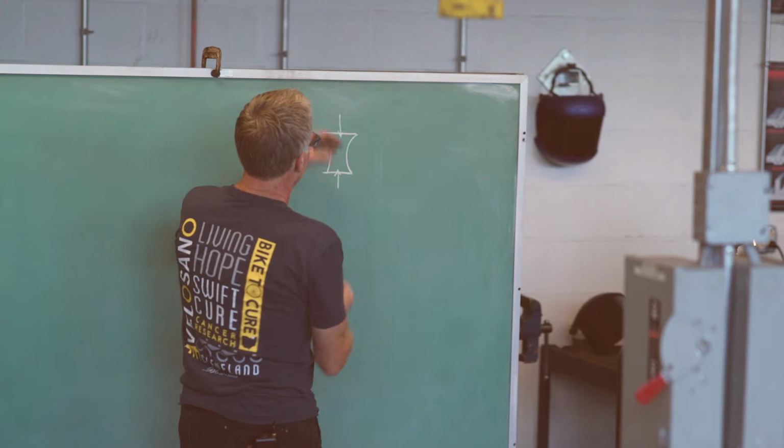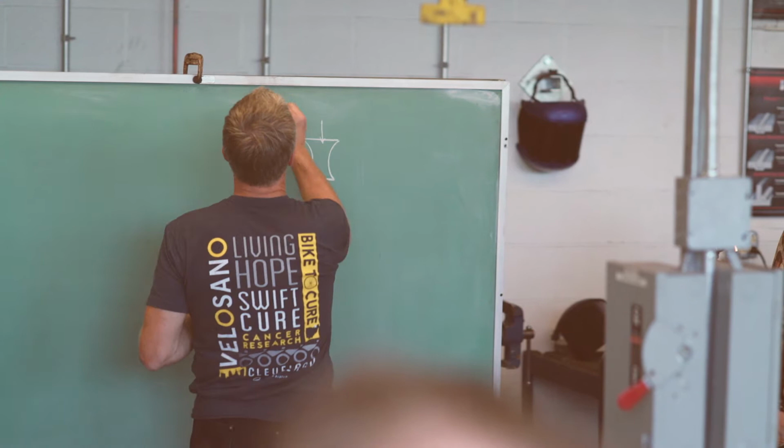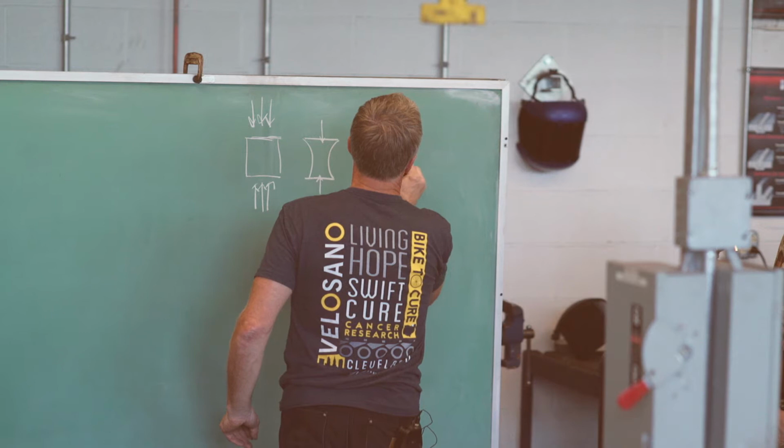So in metalsmithing, when you're raising a vessel, you thicken the edge up by basically doing this right here. If I hit this with a lot of force, now I'm really going to lay into it, like the stuff Tom Joyce was doing with those massive blocks, what you're going to get is this, because the force comes in, hits itself, and pushes out. So you get a different shape.